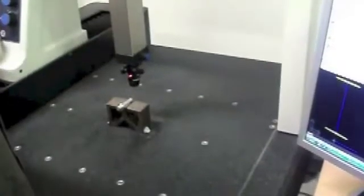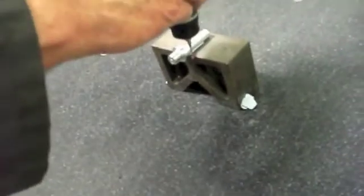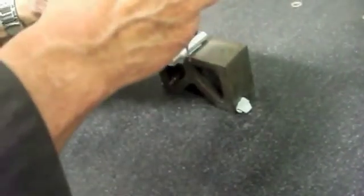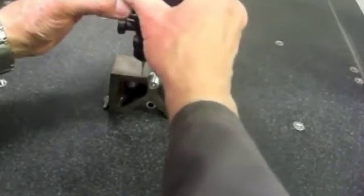Next we want to do the back end. After a minor interruption we'll carry on now, Ken. We're still measuring this component — large diameter. Lock the Y. I'm going to take four points around this diameter. Measure circle — point one, two, three, four. Element finished.